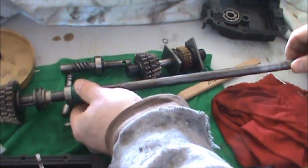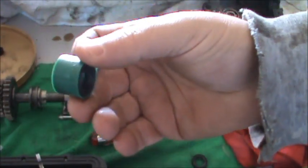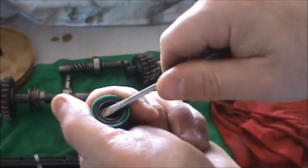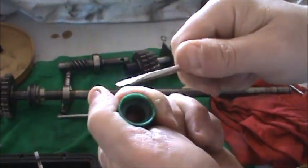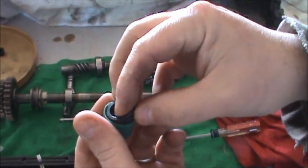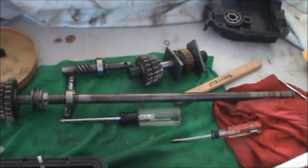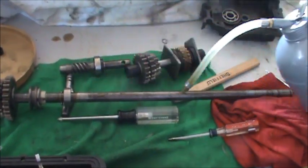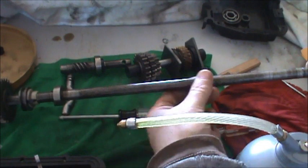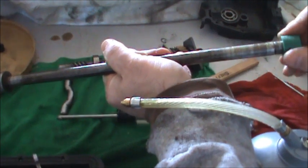Here's how I'm going about doing this: I'm just sliding off the old bushing, which kind of looks like this — the seals are on the outside. You can just take a screwdriver and pop these out with a little twisting. Then the new seal will fit right in here — they're a nice snug fit, so I'm just pushing those in and putting a little bit of oil down the shaft. Once we have that, we can work our seal right down the shaft to where it needs to be.